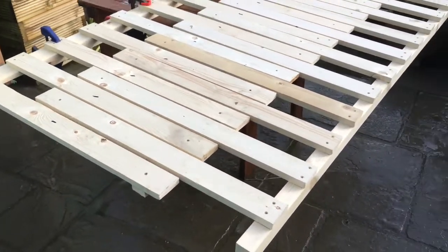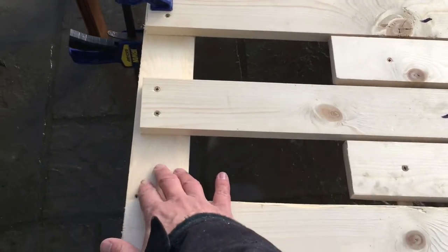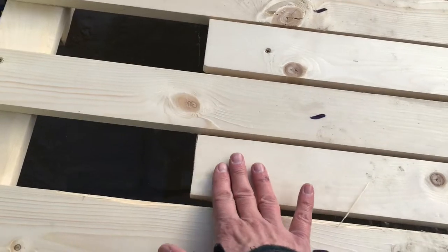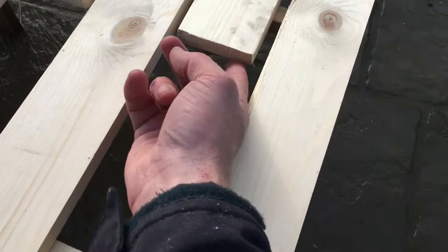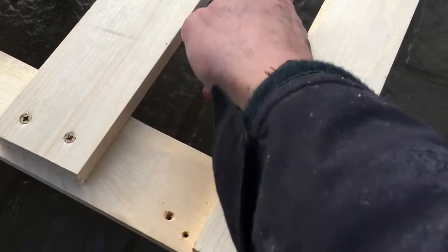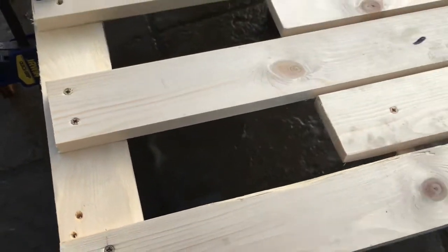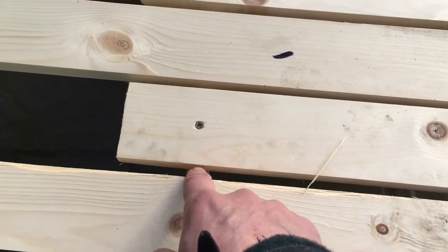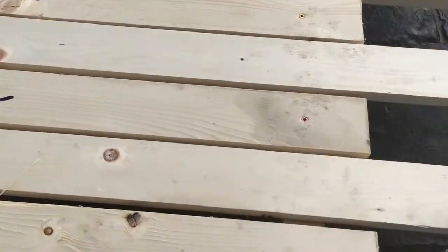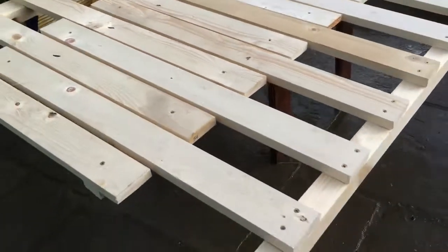I've now built the sliding section as a separate unit. You can see the long cross pieces here which should really be beeswaxed because that really helps to reduce the friction. The sliding parts — I've chamfered the underneath edge of every one. If you have two square edges butting up against each other they tend to lock and jam. If you chamfer them — I've done a slight chamfer on this — they will ride over one another. These are the moving slats, and underneath I've cut down a piece of wood which runs the whole length of the bed. At the other end I've got a piece of 2x2 fixed to the fixed slats and another piece of 2x2 fixed to the end slats.